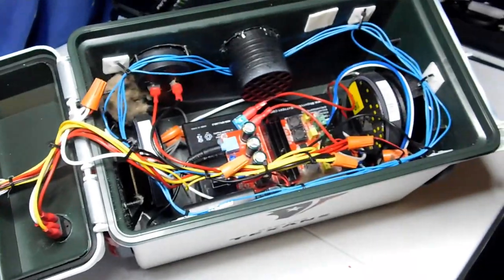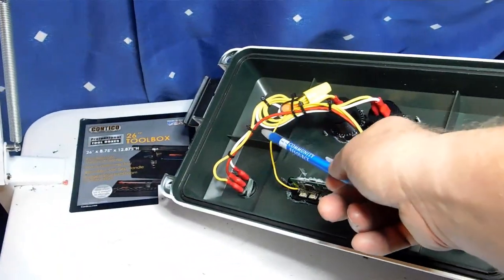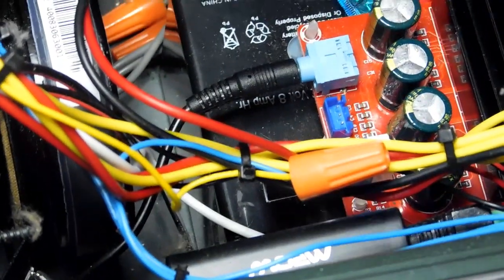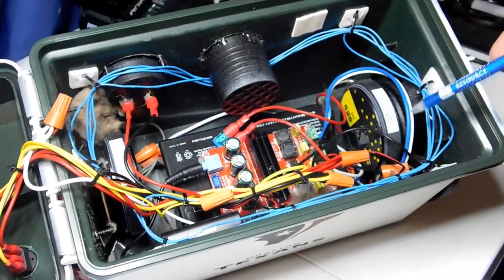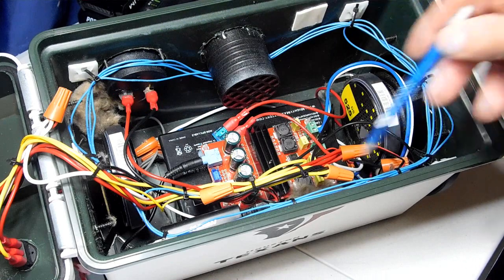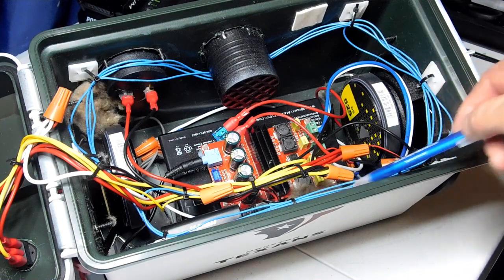On this one I have an internal antenna — you see this blue wire that wraps all the way around like that. It comes from the yellow antenna wire and you can see right here in this little connector the blue wire is connected to the antenna wire, and the antenna wire makes a loop inside the box. You can't really get away with this in a metal box because the metal will shield the antenna, but in a plastic box you can. It's a great way to make a cheap antenna — I've probably got maybe 16 or 20 feet of wire coiled around right here in a loop, and it just terminates somewhere in here where I pulled the insulation off.